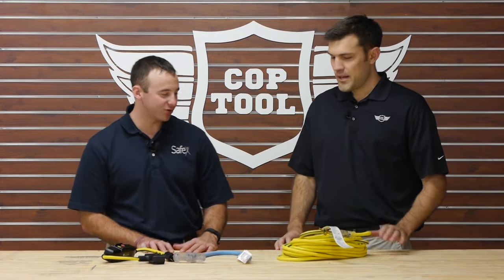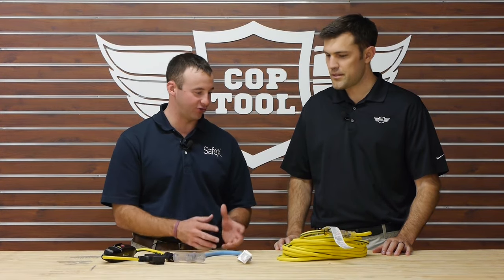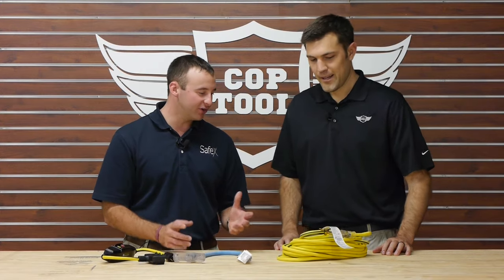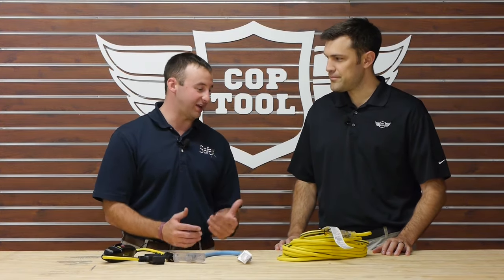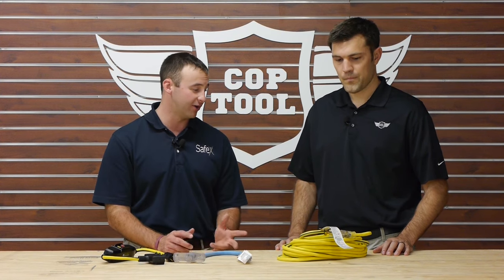Thanks, Jay. I think what we're going to be talking about today is proper configuration of extension cords and extension cord connections using GFCIs. Pretty exciting topic. Absolutely. Recently, there's been a big run of citations for improper cord configurations. It's coming from 1926.403(b)(2). It's not a new standard, but recently OSHA has decided they're really going to start cracking down on and enforcing it out there.